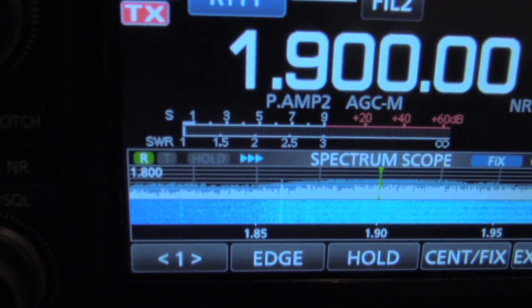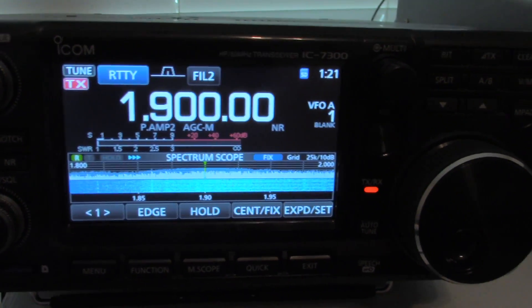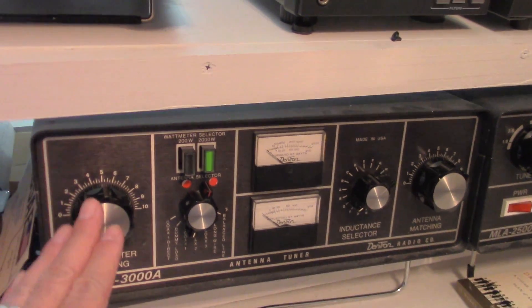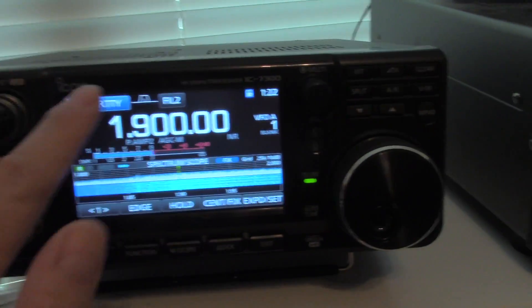There you are — all the way down there. One of the things you might do is set up a little chart like this one, so you can get pretty close to whatever frequency or band you want. This gives you an eyeball or ballpark figure of where to go. It's great for your transceiver to have low SWR as much as possible. When the band won't permit with the antenna you're using, use an external antenna tuner to get the SWR as low as possible, and then you can use your built-in antenna tuner. And that's about it.